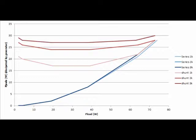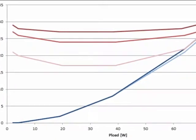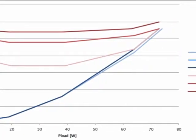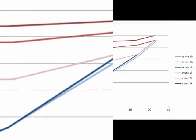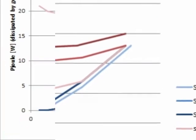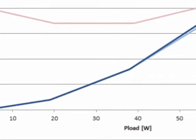Finally, we have a chart showing the load versus the power dissipated in the generator, comparing series and shunt regulators. This data comes from a research paper titled AC Series Voltage Regulator for Permanent Magnet Generators. The paper will be linked below. The red lines are for the shunt regulator. Regardless of the load, the shunt regulator is always drawing high currents, leading to a lot of power dissipated in the generator, which just gets turned into heat. The blue lines show the series regulator. At high loads, it performs about the same as the shunt regulator, because all of the current is needed to drive the load. However, for series regulators, the current draw is proportional to the load. Under low loads, it draws low current and dissipates less power in the generator.